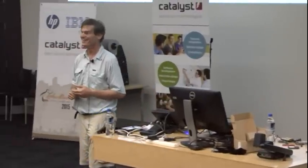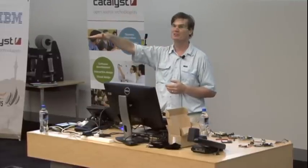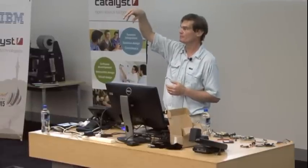All right. The board's starting to look a lot like a flying tricorder. Are you planning on actually adding any more sort of input sensors? Oh, yes. Sensors get added all the time. The flavour of the month sensor at the moment, and the one a lot of our effort is going into, is an optical flow sensor. An optical flow sensor is basically an optical mouse for a plane where the Earth is the mouse mat. The plane has a mouse, and it literally uses the same types of sensors as you would find in an optical mouse.